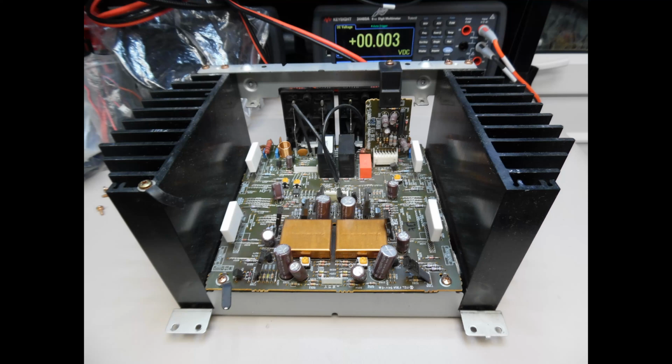And then the vertical circuit board is the protection board, and then when you look towards the front you can see they look like bronze covers, and that's the input signal processing part of the amplifier. So that's where you would find the transistors associated if you had an issue with DC offset. And you can sort of just about make out the trimmers just in front of there. They're used to eliminate the DC offset, and then we'll show you a little bit later that there are two other sets of trimmers left and right to set up the current for the AB mode, and then also the class A mode.